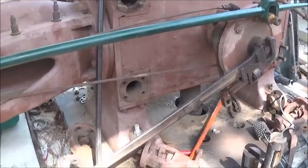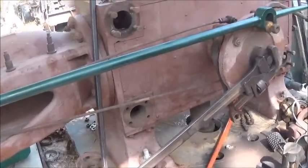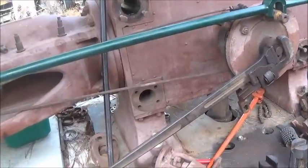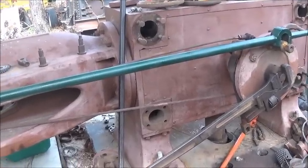And let me see, I got my ring in. I had one broke ring that I broke personally myself getting unstuck. So I've got it. It's got 2 rings. They're 14 inch bore, 3/4 inch wide, and 310 thousandths depth. So that's done. I've got a new rod that I bought.